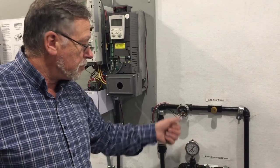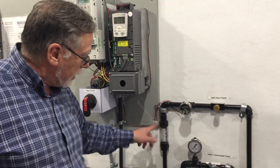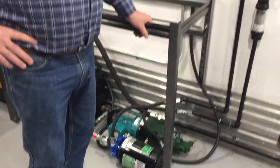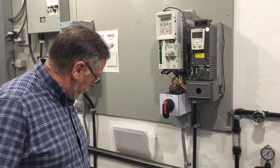If you throttle the gear pump output you're going to drive your pressure high, so we've got a Murphy gauge tied back into this as well. Down here on the centrifugal pump we can starve the input, so we'll teach you what cavitation sounds like, looks like, and feels like — using your senses.